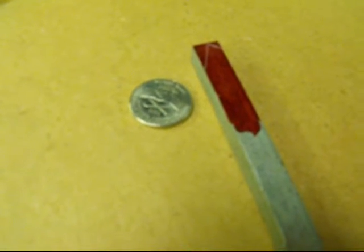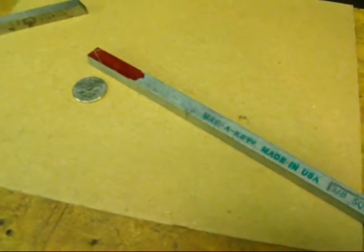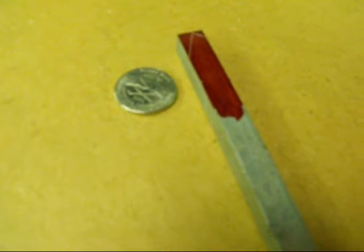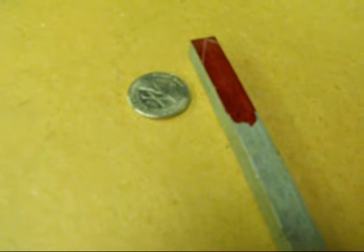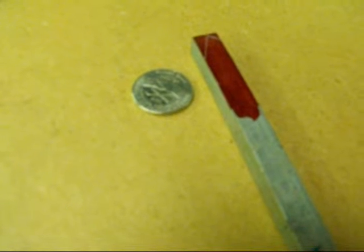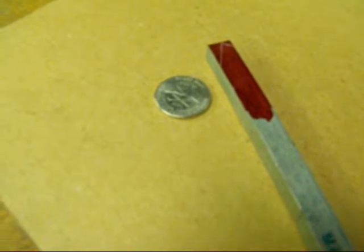Also, I forgot to tell you the other reason I'm grinding this out of a long piece. It's much more able to absorb the heat, and as you grind your high-speed steel you're going to find out it really heats up. You've got to keep cooling it, and it's always easier if you don't have to keep taking it off the grind wheel.